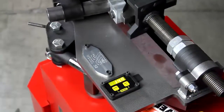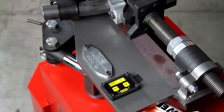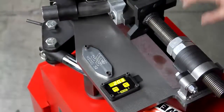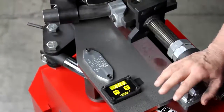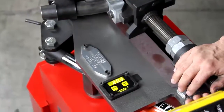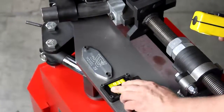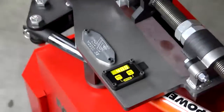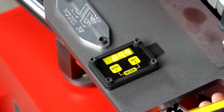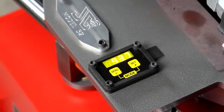Let's go to 20 degrees manually, totally controlling it with the pendant. I'm about a tenth off — and now I overshot it a little. In manual mode you won't get quite the same accuracy as auto mode, but you'll be close. Now we'll let the computer take over. We're going to 93.5 degrees — let's go on the 93.5.